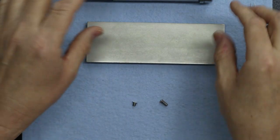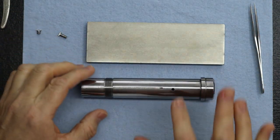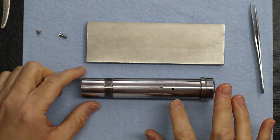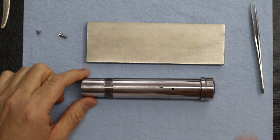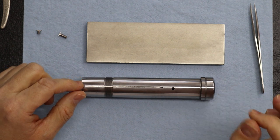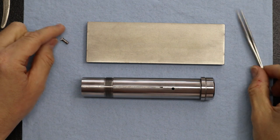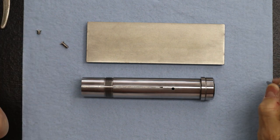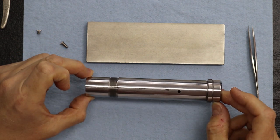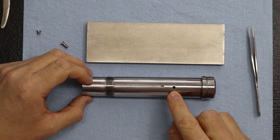So what are the steps? First, most important: in all the Levin ball bearing style spindles, the keys are press fit only, they aren't riveted. I stress that because in a lot of watchmaking lathes, the manufacturers would rivet the key in. I've taken apart used Levin spindles where prior users have replaced the key and riveted it in.